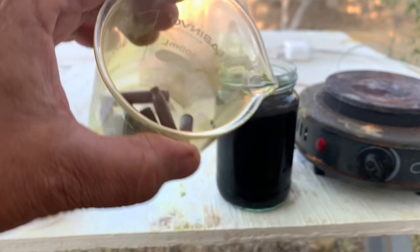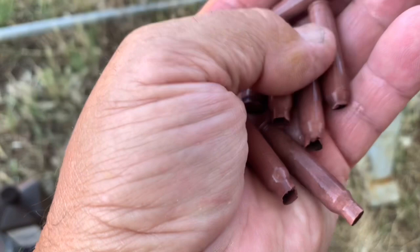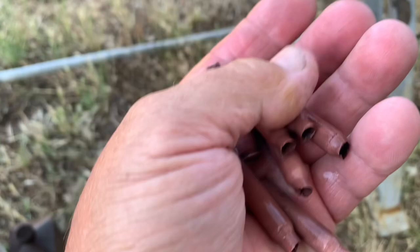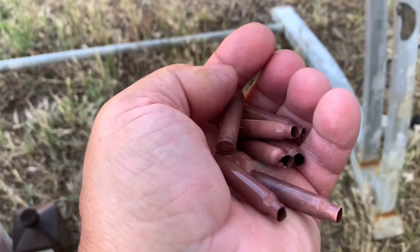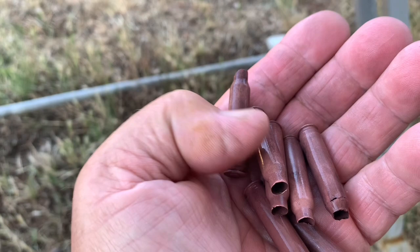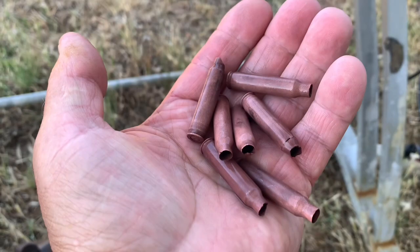Okay. See, the brass became copper color because zinc dissolves in this solution. Copper stops dissolving as soon as the potassium nitrate stops working: no more nitric acid, aqua regia stops, the reaction stops, because hydrochloric can't penetrate this copper layer and continue dissolving everything. So in this case, now I don't need any more of those ones, we're done.